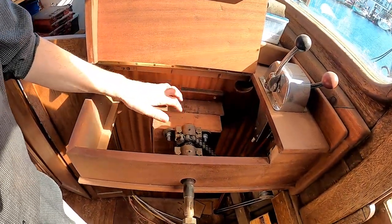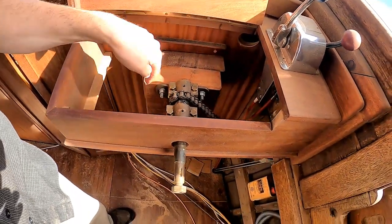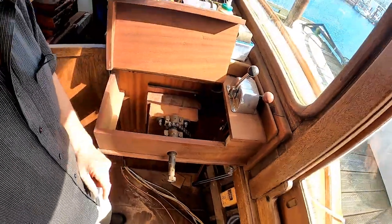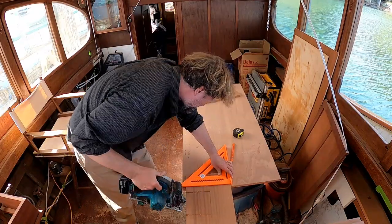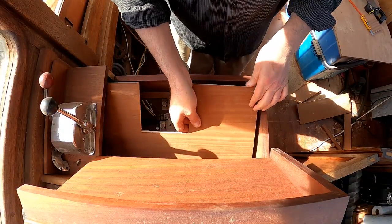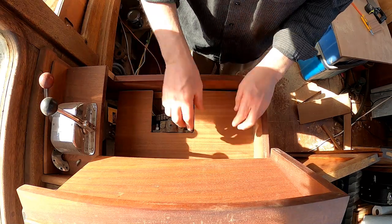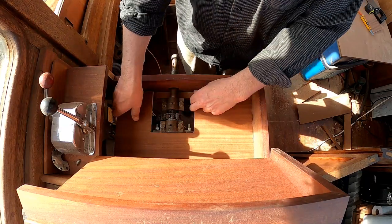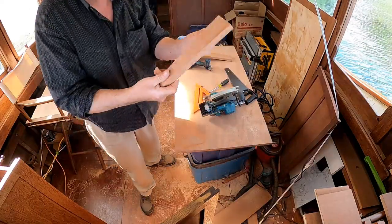What I'm going to do, right on to the surface of this big set of blocks that holds the steering mechanism, I'm going to put a piece of plywood with a little cutout. That will allow me to put some bus bars and terminal strips and actually some relays — we'll get into that later. There we go, beauty. Okay, that creates a little panel where I can put some stuff and still have access to maintain the steering assembly.